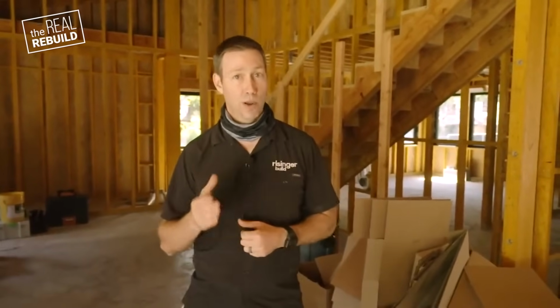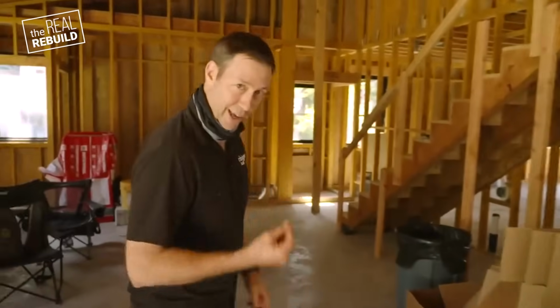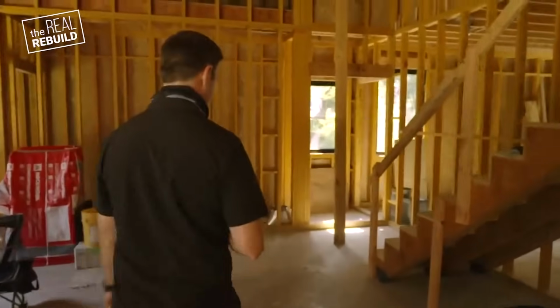And I would say whether you're building a house to this crazy tight standard or you're building a more modern house to, let's say, just code built standards, you probably need a fresh air system, and you probably need a really good one, because we don't want to rely on fresh air just when the wind is blowing, right? Or when your furnace kicks on. We want that fresh air all the time. Now, specifically, we're installing a Zehnder ERV in this house.